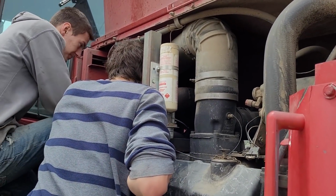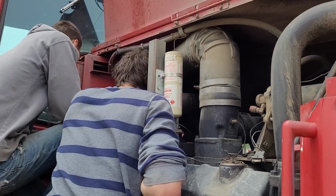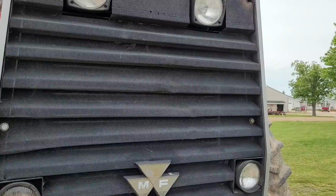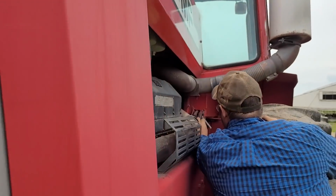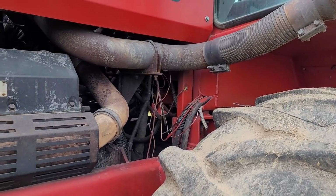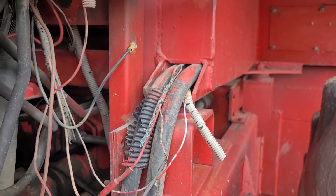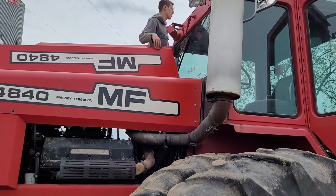Right here, you broke it off down to here. I broke it off down to here, but there was a kind of a sliding clip. Yeah, I guarantee this is your power supply up to your radio. So you're gonna have to pop the top and then do a continuity, because you got wiper, blower. Oh man.